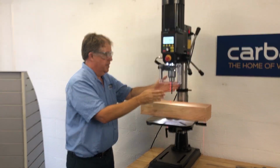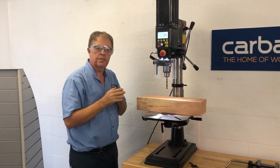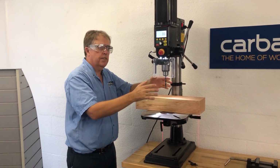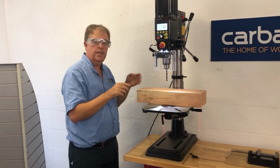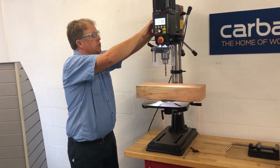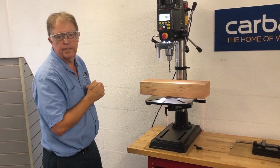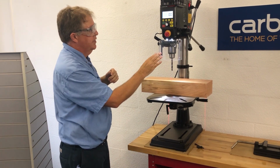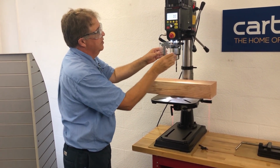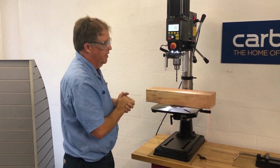There has also been an improvement in this area. So drill presses of this size normally are what they call a 15-inch drill press, so they can handle a 15-inch diameter. This one is 16-inch, so they've moved it out a little bit. We've got all this cast iron sitting up in here to support that little bit of extra depth. Obviously, we also have the safety guard systems, etc. So you can see even a sensor coming on that we have the safety guard open.